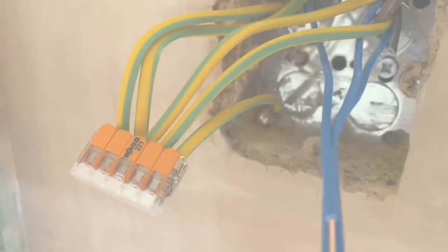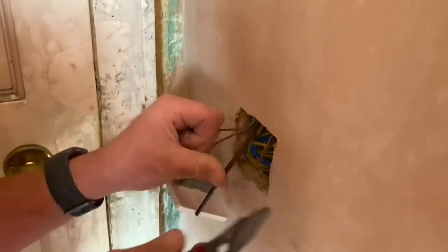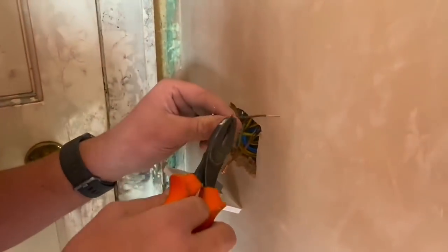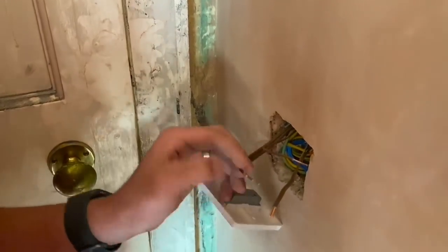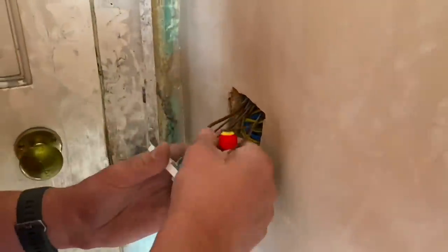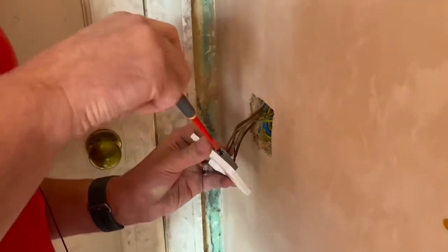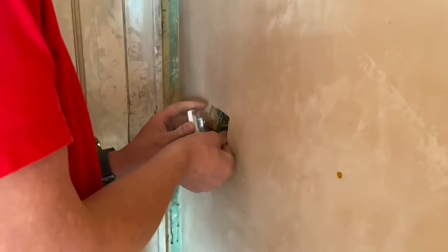The screw terminations — that's probably where you find a budget one, usually quite small and not the strongest connection. How are you finding the terminals? Great — nice big chunky fixings, get a decent-sized screwdriver in there. Are you trying three doubled-over cables going into one terminal? Give it a go! One, two, three — straight in, easy, no problems. So the generous-size terminals on the back of these switches is a positive feature for you? Definitely — compared to how they used to be.